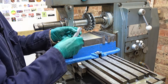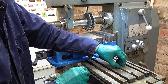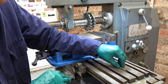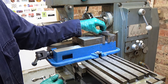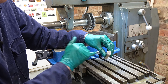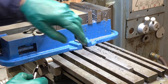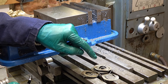I spent a lot of time trying to decide how close a fitting to make this in the T-slots. There's a little bit of movement — it's perhaps better to have a fraction of play, because there's nothing worse than getting it too tight and having to hammer it in. That'll be okay. The next thing is to drop it back in the other way up and machine the top down so that the step from the edge to the top is only three millimeters. The T on this measures just under half an inch, a little more sloppy than I wanted, so when I cut the keys for this vice I'll use one of these shims.